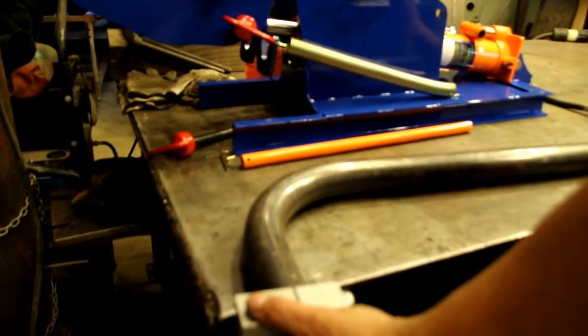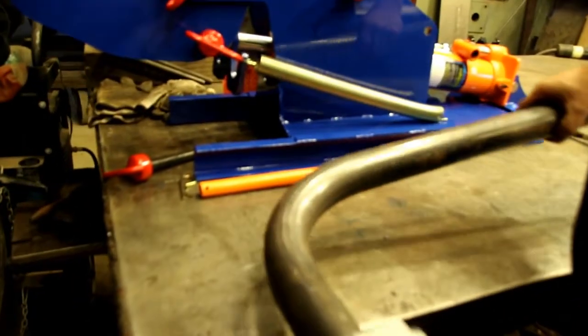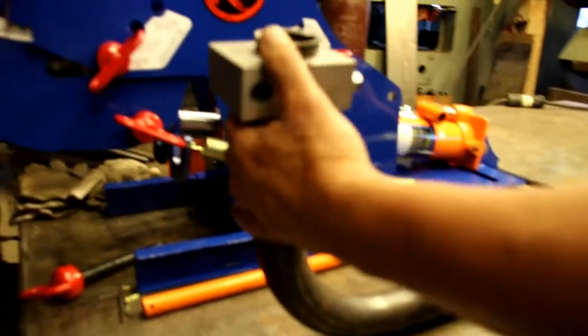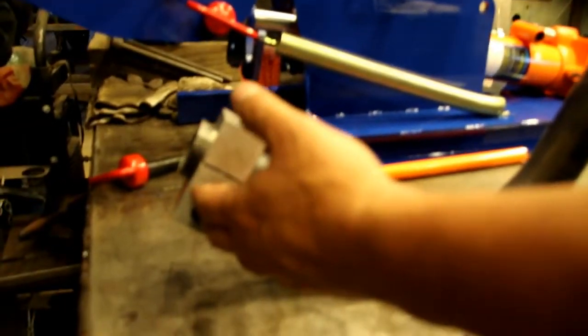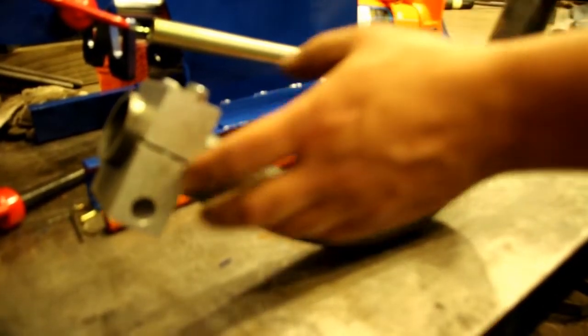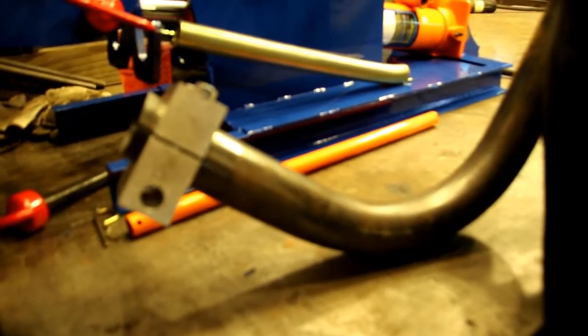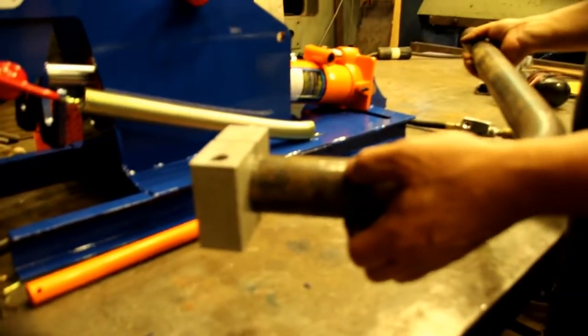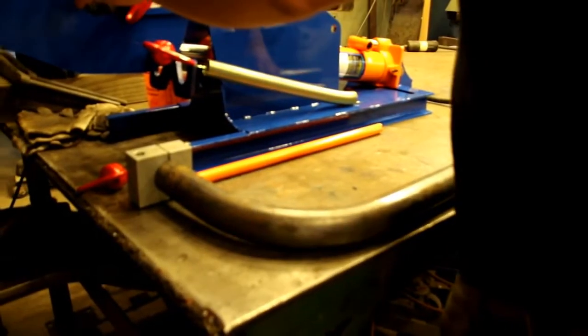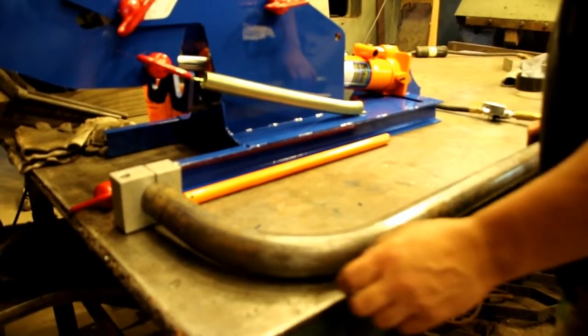There's our tube out of the bender and it looks pretty good for a 90, with very little deformation. That's a very nice 90 on this heavy wall tubing. The very nice thing about this bender is if you leave your block on, you can register it back in the exact same place. If you want to go another 2 degrees, 5 degrees, 10 degrees — whatever you want — you take this block, put it back, and it's perfectly registered to bend again. So don't take your block off until you know you like your piece. We'll make a few more sample bends and adjust our pointer so we hit right on the money every time.